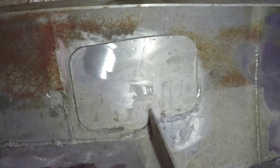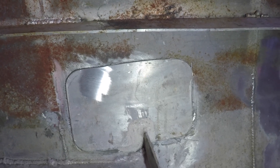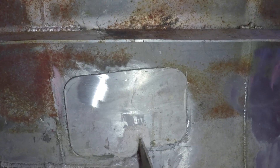As an aside, on this side you'll see this plate that I put on a year ago. I used 3M 5200. The one I just showed you was incredibly difficult to get off, and I anticipate this one being even more difficult — and it just speaks to how good that 5200 does bond. I think you could probably not fix this with a weld the proper way; you could just leave that there for a long time and not have a problem. But if you follow their bonding instructions perfectly, you totally can use a 5200 patch. It seems to be really strong stuff.